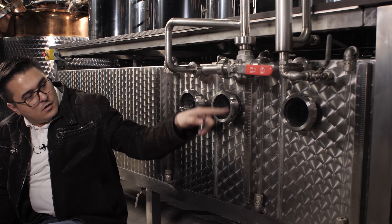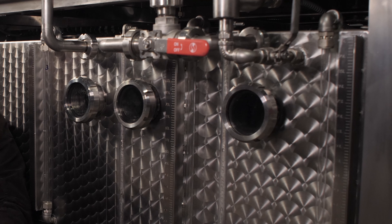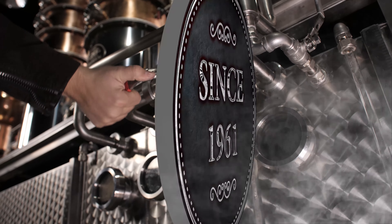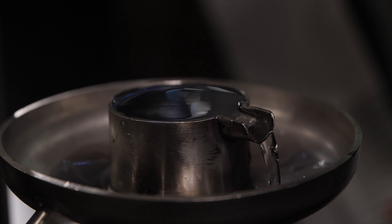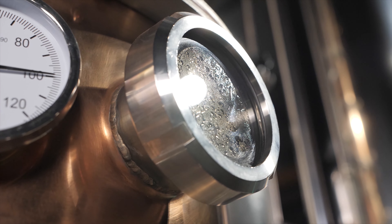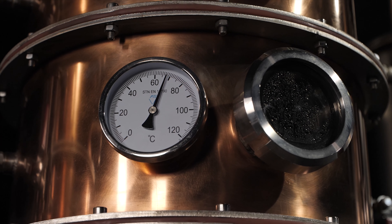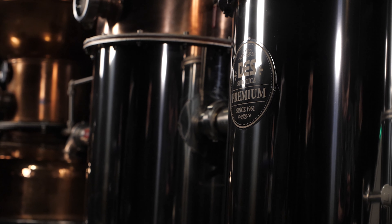The still is also equipped with collection tanks. It has three sections: the first section is 150 liters net capacity and is made for collecting methyl alcohol — the head collector. It is followed by a second section made for tail collection, and the last is a 500-liter ethyl alcohol collection tank. They all have volume meters so you can track how much they are filled. This works by a three-way valve that facilitates easy separation of alcoholic fractions by redirecting the flow to each individual vessel.